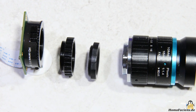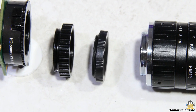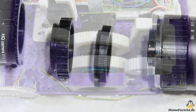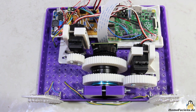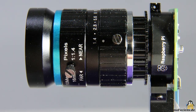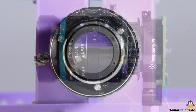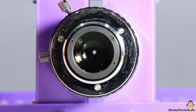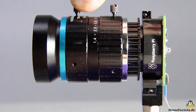For the 16mm lens, the appropriate adapter ring must be fitted to the camera module, otherwise the distance to the image sensor is not correct and you will only get blurred pictures. This telephoto lens is operated via two servos: one controls the ring for the aperture, and the second servo is needed for focusing. The aperture is activated via the rear ring with a value of 1.4 at fully open and 16 at the lower end. The focus is adjusted via the front ring and a minimum distance of 20cm to the target object is needed to get non-blurred results.